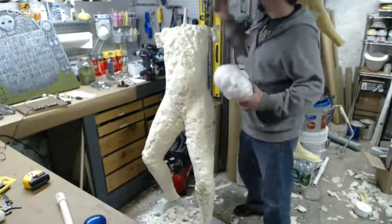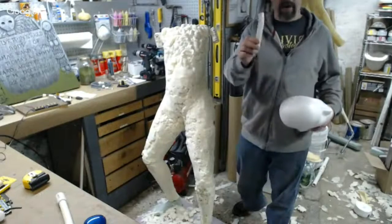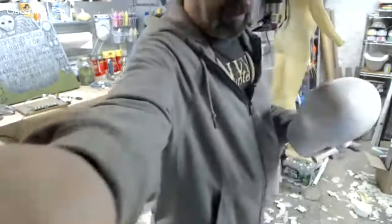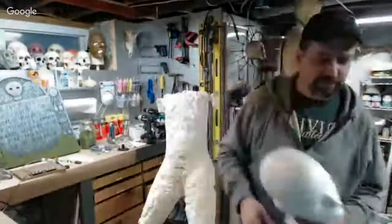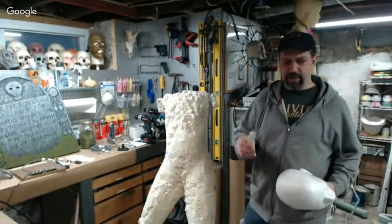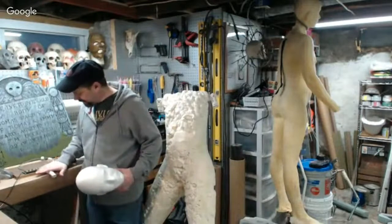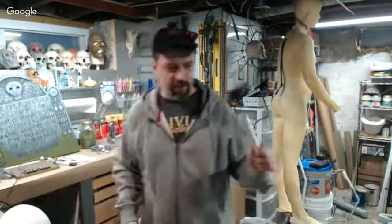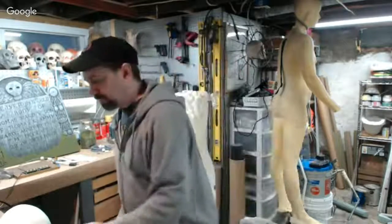And we bent the piece of PVC. So anybody who wasn't in here already missed out on learning how to bend PVC. Let me move my camera back up so you guys aren't staring at my belly while I'm talking. But pretty much all you do is you hit this with a heat gun. You sit there and just kind of roll the PVC back and forth with the heat gun on it. And then once we got it heated up so that it would bend, I took another piece of PVC with a coupler, threw it on there, and bent it so I don't burn my hands.